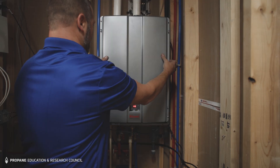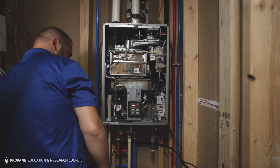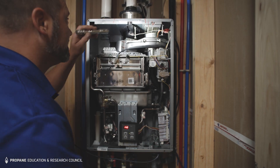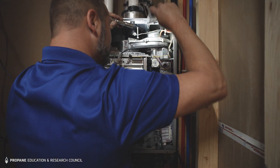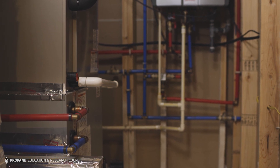In the past I've worked on units that use tank water heaters to deliver hot water to the hydronic air handler. With using a tankless water heater you're not storing all that unused energy in that tank anymore — you're going to get 100% of your energy to your air handler for the demand in your home.